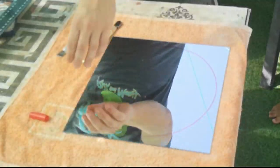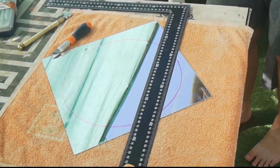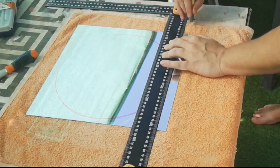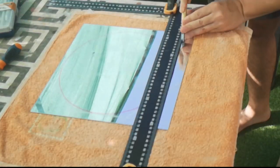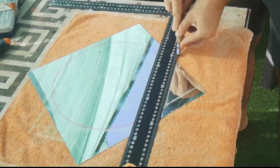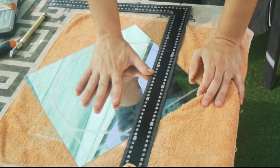I'm doing the sped-up version again with a time lapse because I made the same mistake and this time even worse - I did multiple cuts before cracking. You should only do one score line and crack it, then one score line and crack it, so you control the cracks. Because now I have multiple mini cracks on all corners, so every little thing I do has the potential to crack right into the glass center.